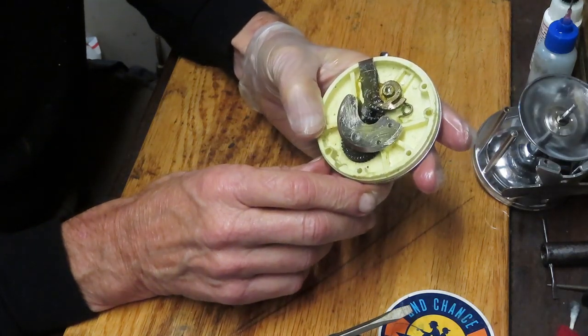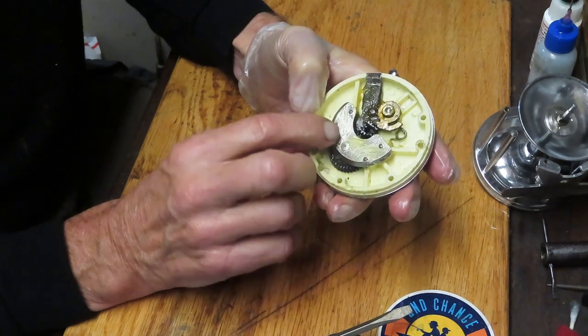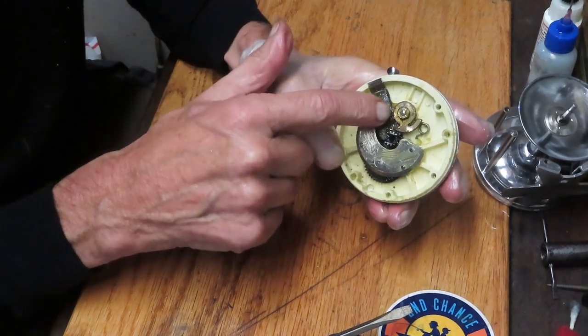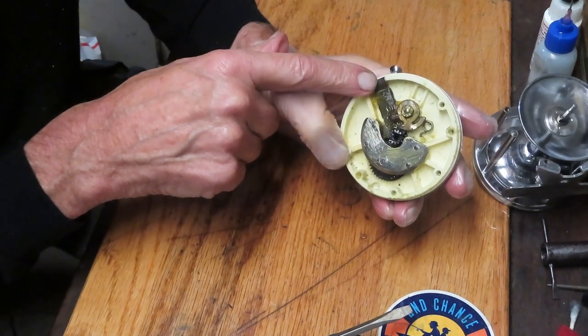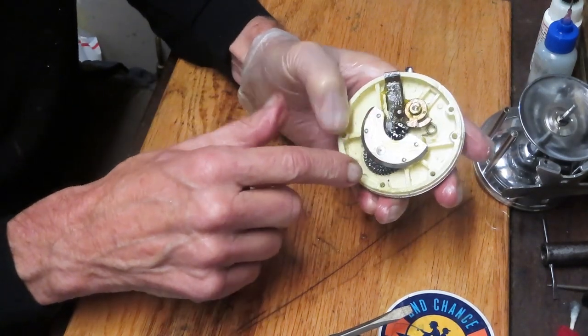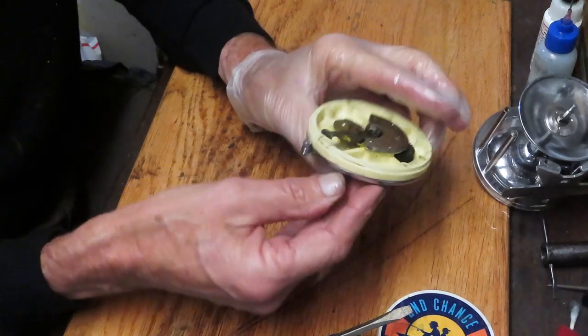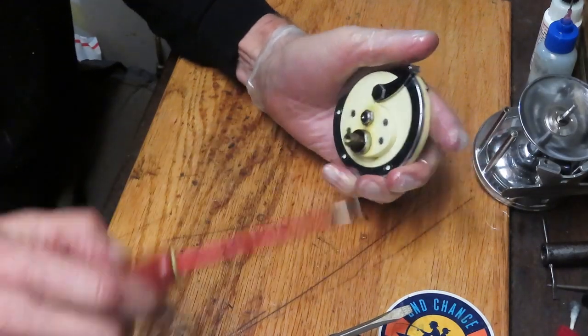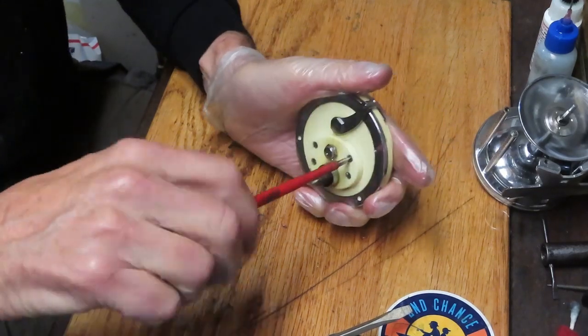This is your inside look at this. 4 screws hold on the bridge. This is your jack, kind of a different situation. This is your eccentric, which is going to press the jack in and out, your pinion gear, and the like. Notice that the jack goes into a little slot in the top of the case here. I'm going to take the 4 screws off now.